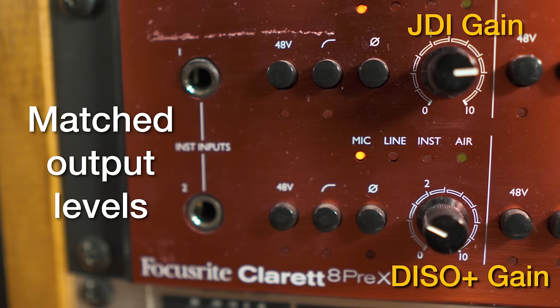I mentioned that I think the Deeso Plus does an even better job than a standard DI. It does everything we've talked about — quarter-inch inputs, balanced XLR outputs, and an additional set of quarter-inch outputs to use as a patch bay on your pedalboard. It's designed for guitarists to use specifically with modelers. But what makes it different? Pinstripe Pedals actually calls this a dual line isolator. A standard DI actually drops your signal down — say you're coming out of the Walrus ACS-1, your signal is up here, the DI brings it down, then you use the preamp to bring it back up. Those are unnecessary steps. The Deeso Plus maintains that signal all the way through, giving you a clean, pure signal. You'll notice right away that you get a lot more output and won't have to crank your preamps as loud, which means less noise and a better sound.